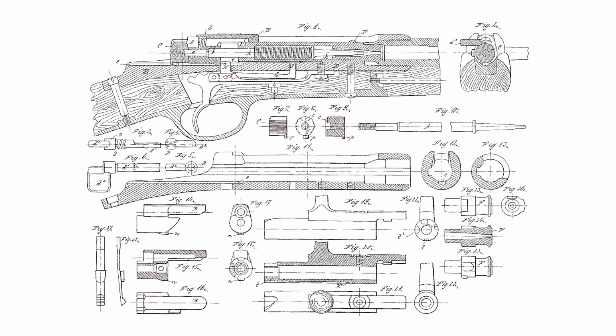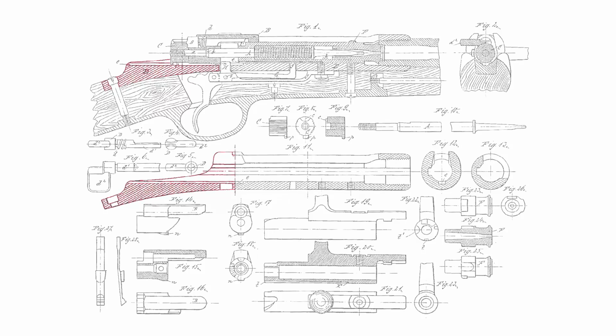An ejector was added, that's kind of handy. The vertical blade was gone from that firing pin, the one I showed you last time. It's now tapered, it no longer hangs things up. The out-of-battery lock was now handled by an extended raised channel in the rear of the receiver, in which an extension on the cocking piece rides. This looks a lot like that Italian Vetterli 87 modification.